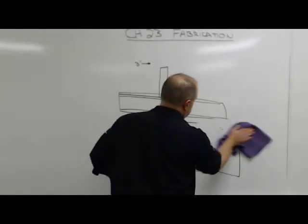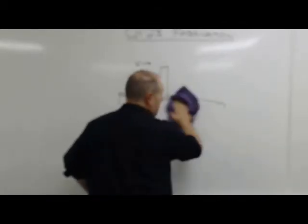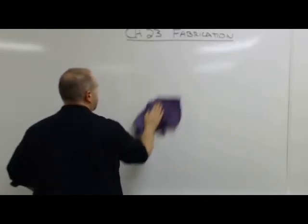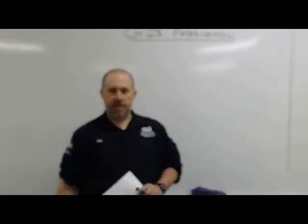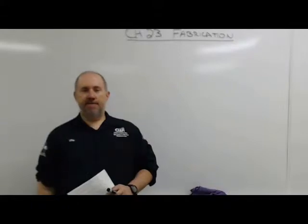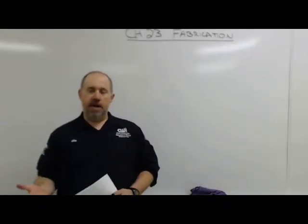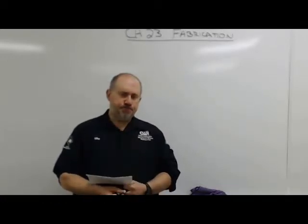Tolerances. Tolerance is a big subject. We talked about it in Blueprint. We're going to talk about it now because it's real, real important. Tolerance is simply how close a part has to be to the drawing's dimension to still be acceptable. Most shops run about a 1/16 of an inch shop tolerance, which means most parts can be about a 1/16 of an inch, either small or big, and still work. But that's not always the case.